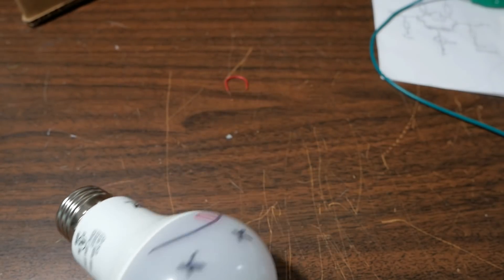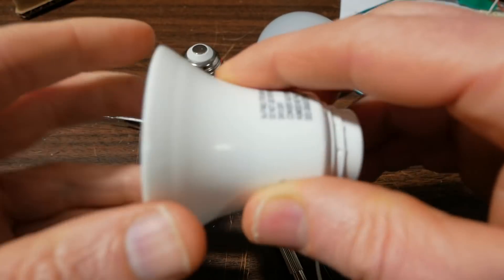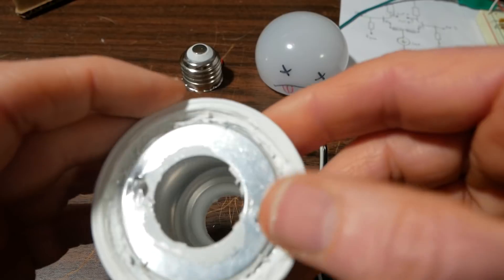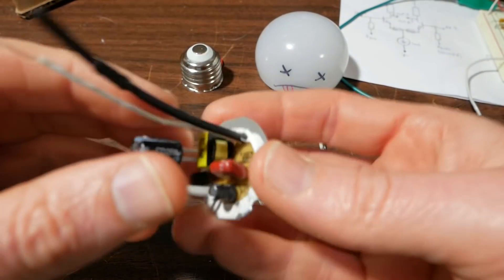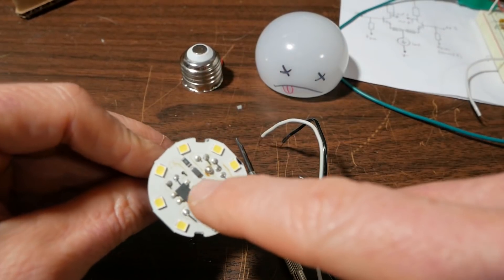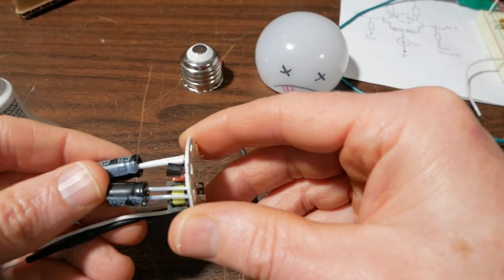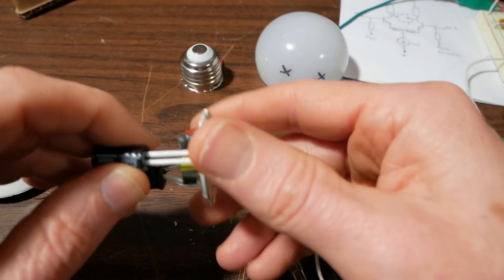I got this thing apart. It seems to have a very large aluminum surface area — you can see in there and around here — a larger area compared to a lot of other bulbs, which is probably why it runs at a cooler temperature. Keeping price as low as possible, they seem to be going with a design with everything on one board. We have some surface mount components on this side of the LED board and through-hole on the other side, and a TO-92 cased device — that's probably the first time I've ever seen that in an LED bulb. Usually it's some sort of surface mount arrangement.